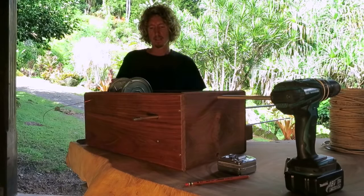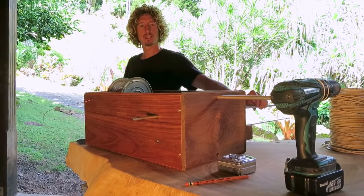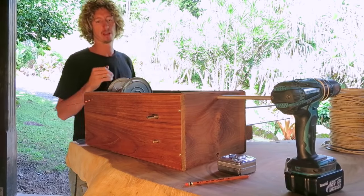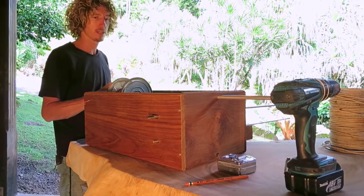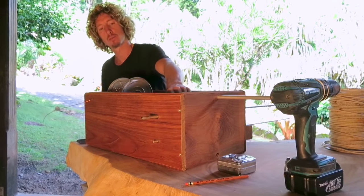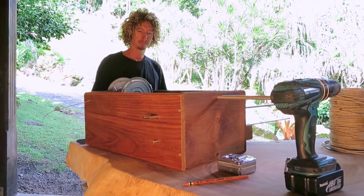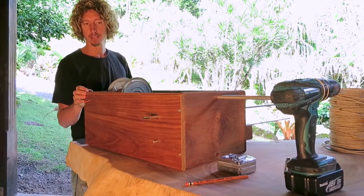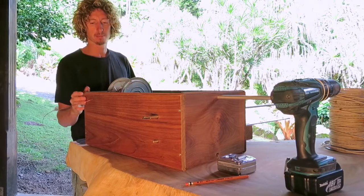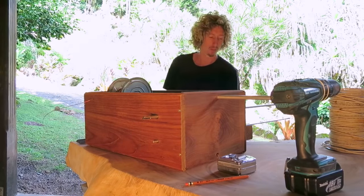Okay, here we are with the box that I've made. That's some timber I had lying around. I made a jig. There's 10mm and 6mm rod, which is going to be used while we wrap the copper wire around to make the coils. The rod itself can be a little bit larger or smaller, as long as you have a small gap in between the two coils when you insert them. This box I made so I can reproduce and make many, many coils. It's a simple box that holds everything, and I can create a lot of coils fast.